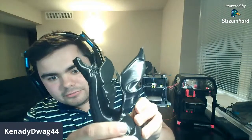I keep forgetting we have this set to 90 millimeters a second because I'm watching this thing going like, good God, that's fast. I have not gone that fast on this printer yet, except for these tests. My max speed was set to like 65. I just printed this Dragon. I was running 4,000 acceleration, 80 millimeters a second perimeters, and 200 infill. There we go. And it looks pretty good.